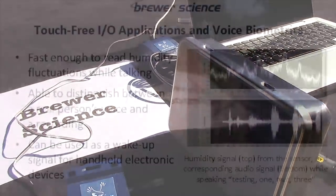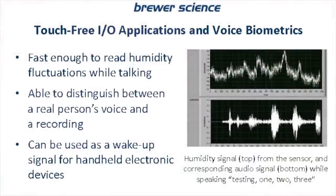There are a lot of applications for temperature and humidity sensors — it's so universal. But the problem with sensors currently on the market is they are capacitive type sensors with a response time of five to fifteen seconds. When you use a sensor for voice recognition or breathing monitoring — where in one second you exhale and inhale multiple times — if the response time is 15 seconds you won't be able to track that humidity change. That's where these high-speed sensors are very, very useful.